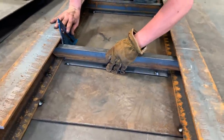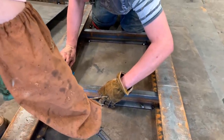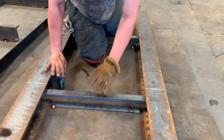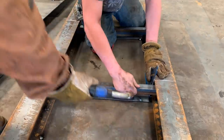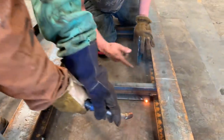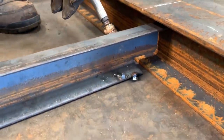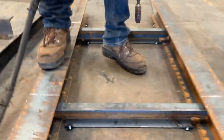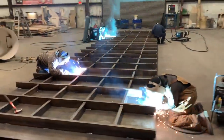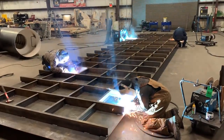All right, so he'll put it in there, he'll square it up, and he'll square up the other side. And that's all they do. But then it leaves a weep hole for drain, and they can weld it on the sides. And that's how we make our channels fit the channels, or fit the I-beams, depending on what we're doing.